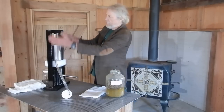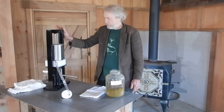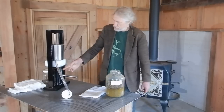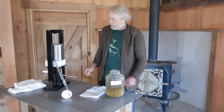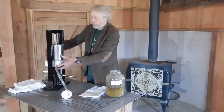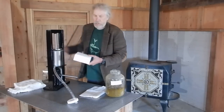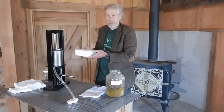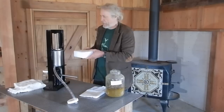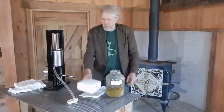This is the H frame, which is built out of very sturdy steel and is completely unbreakable. This is the 6-ton jack. These are the springs which bring down the platen. This is the extender block, which will help painlessly raise the pressing pan without extra jacking action.